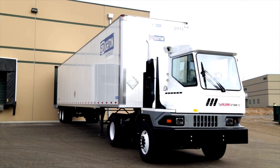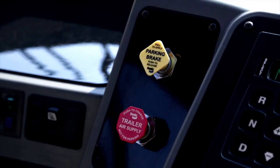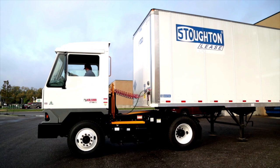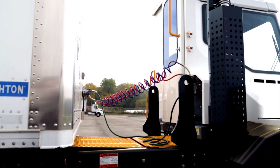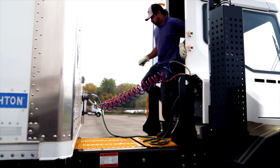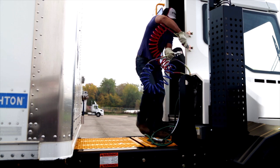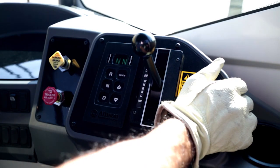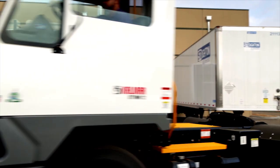Now we are ready to spot the trailer. Once the trailer is relocated and the vehicle combination is completely stopped, shift into neutral and pull out on the trailer air supply control (red). This will apply the trailer parking brakes only. The parking brake control (yellow) should remain in with the tractor parking brake released. This will allow the T2 to move gradually as the trailer is lowered. Using the boom control lever, lower the trailer until the trailer supports are resting completely on the ground. Set the emergency parking brake control, then disconnect and store the air lines and electrical cable. Release the tractor emergency parking brake control. Depress and hold the fifth wheel unlatch control valve as you slowly pull away from the trailer. Once the fifth wheel is completely clear of the kingpin, release the fifth wheel unlatch control and go to the next trailer.